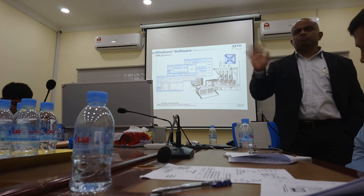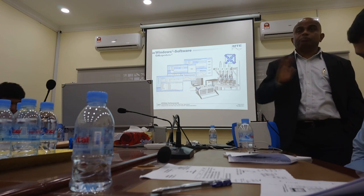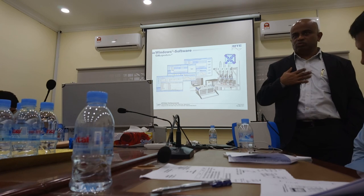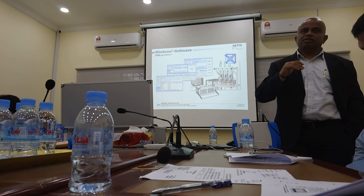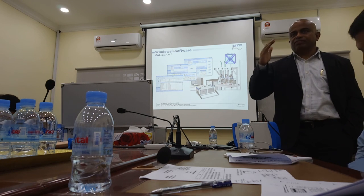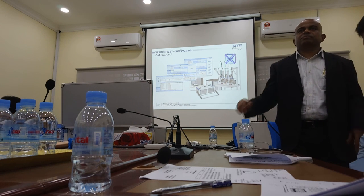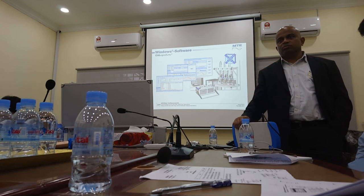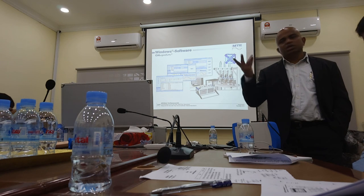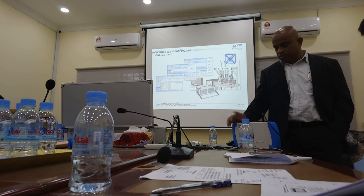On average in the industry, people verify every 2 years, but the better practice is 1 year. If I am a user like you, in the first year I will verify very often, and in the second year I verify every year. Then if I see it is stable, I make it 2 years. Later, if I find some fault, or I go for repair, or I see some problem, then I do it more frequently. Otherwise, you can relax it a bit. Again, it depends on the user. If the user is very rough, then you may need to test it more. But typically 1 or 2 years. If you have your own internal testing procedure, 2 years is ideal, because testing is also expensive. Good question.